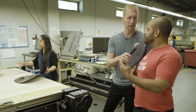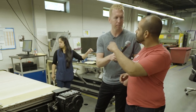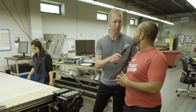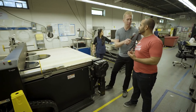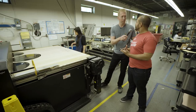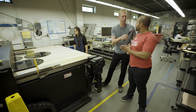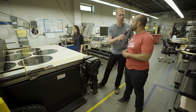Switching between different head sizes is actually very simple. This is all done digitally, so all the operator has to do is go over to the computer there, type in the head size, and it'll all get worked out through our computer systems. Consistency is key here, and that's a big part of our processes. We have quality control inspectors to make sure that every time a film is cut, it's made to our specifications, and we've hardly ever seen much variation in the different types of products that we make.